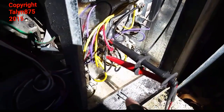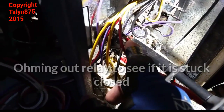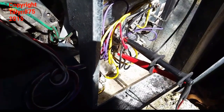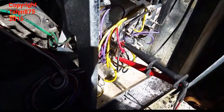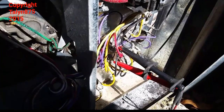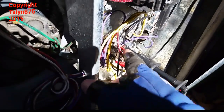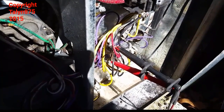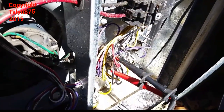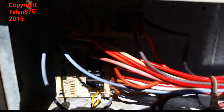Looking down inside the heat kit, the blower tab is on the top row of the sequencer. A sequencer stuck closed sent power directly to the blower terminal on the normally closed section of the blower relay, meaning the blower was not calling on the G wire — yet it still powered the fan as if the heat strips were on. The heat strips were not on, but that side of the relay was stuck closed. Additionally, the red wire from that section ran up to the contactor instead of to the blower control board where it's supposed to go.